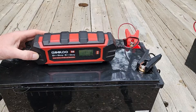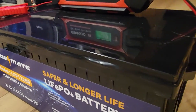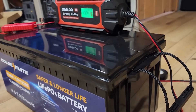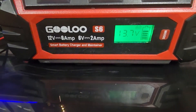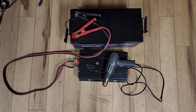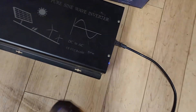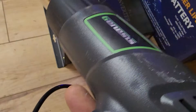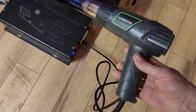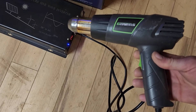Apparently if I had done things correctly to wake it up with voltage, I wouldn't have needed to open it. So I hot glued the lid back together and then ran some electrical tape around it just to seal it back up, and I'm going to go ahead and charge that completely and see how she does. Just for fun, I threw on an inverter with some jumper cables real quick to make sure we're still getting output out of this guy, and a heat gun — so you do have power. She is working.